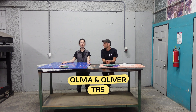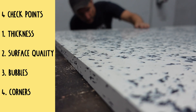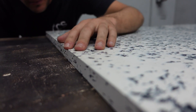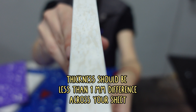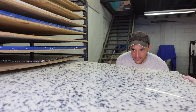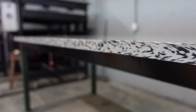The first step to understanding how to make a perfect sheet is knowing what to look for. We have four points that we always check: thickness (also known as tolerance), surface quality, bubbles, and corners. Thickness can be quite a challenging issue and it's something that we look for really meticulously when assessing our sheet materials. Ideally you have less than a millimetre difference across the whole thickness, and there's also the question of the centre of the laminate sometimes being thinner. Essentially you want a uniform thickness.